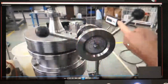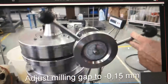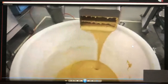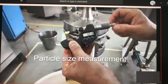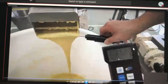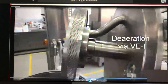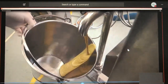When we have product between rotor and stator, we can close the milling gap. We then measure the final particle size. After grinding we also have to deaerate this mustard — we use the standard sieve with 1.5 mm holes, and then in the end we discharge it after deaeration.